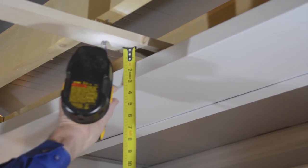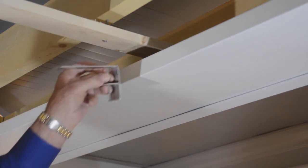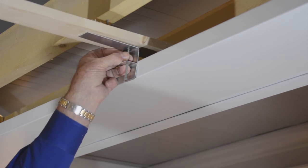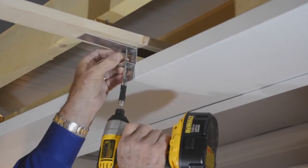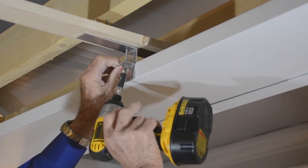It is important that the screw that holds the panel latch to the panel latch suspension board be at the proper distance from the panel, and that they be plumb to the vertical side of the panel. Magnolia supplies a jig for use in piloting the panel latch screws to accomplish this.